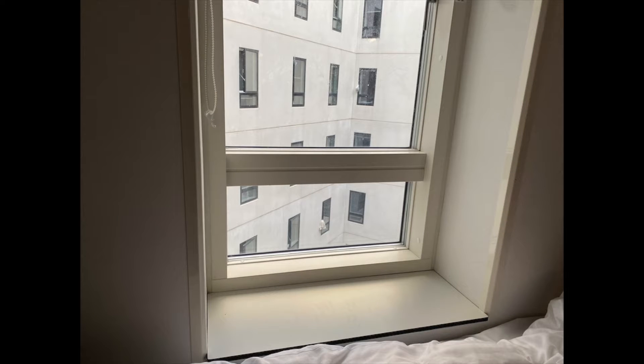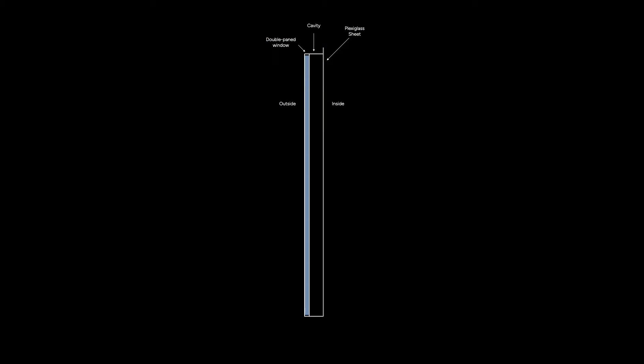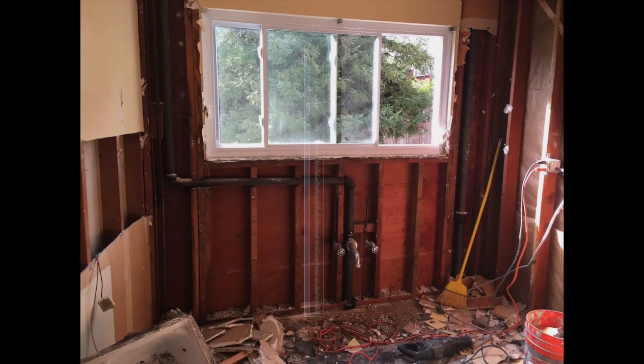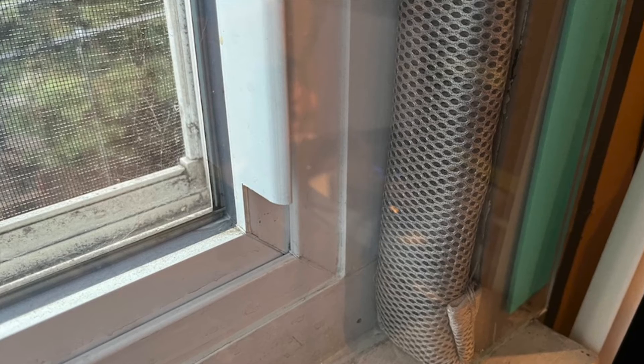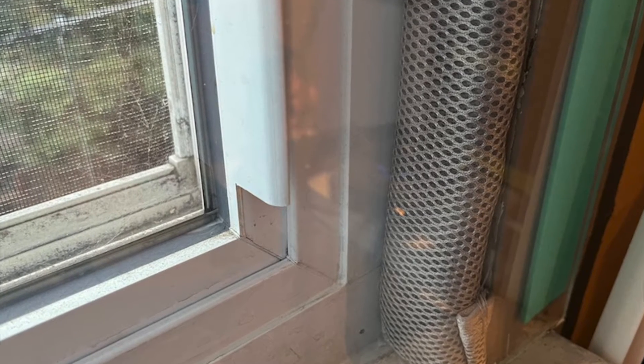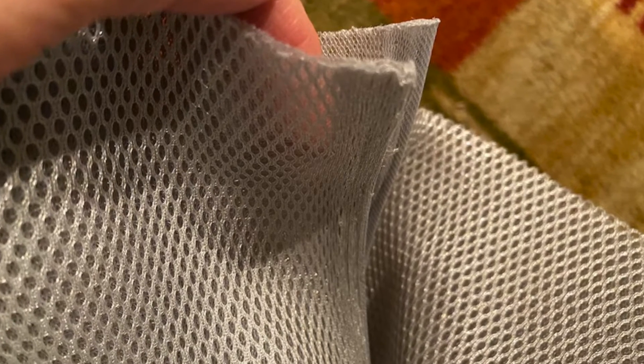This is probably most effective when you already have good walls in your building and you just have bad windows. If your walls are pretty soundproof but your windows are leaking noise, you want to do everything you can to make your window insert as successful as possible. In my case I have very thin external walls that let in a lot of low frequency noise. The available space inside the window frames is less than one and a half inches for me — not a lot of depth, but it creates an empty cavity between the plexiglass and the original window. So I bought some very inexpensive materials to build a sound absorber for inside that space.